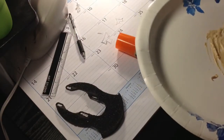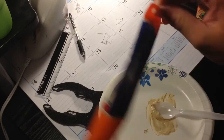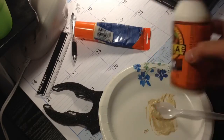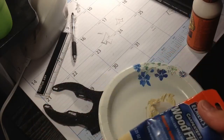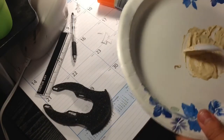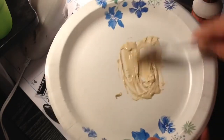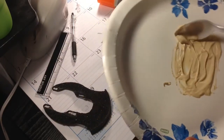What this does is use the bonding agent from the wood filler and the durability of the wood glue. Because if you just use wood glue on the board, it'll just peel off easily. And if you just use wood filler on the board, it'll stick and stay on, but it'll scrape away easily. So what you do is mix them to increase the durability and bonding to the board, so it'll look a little bit neater.